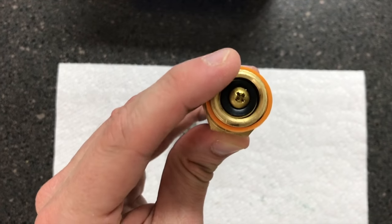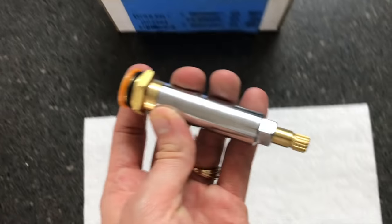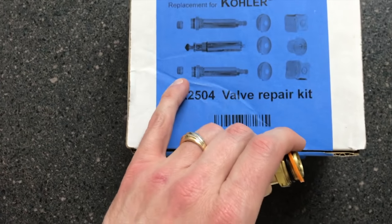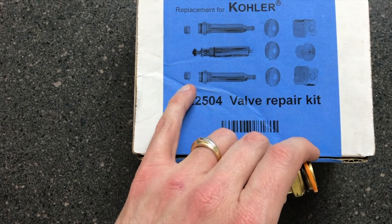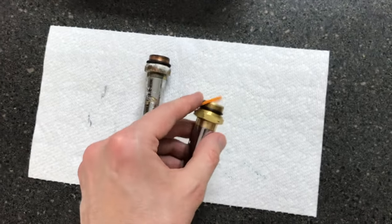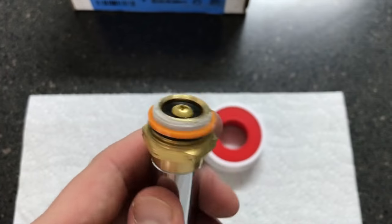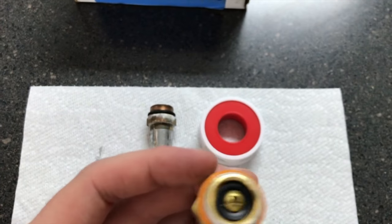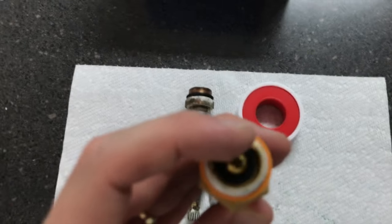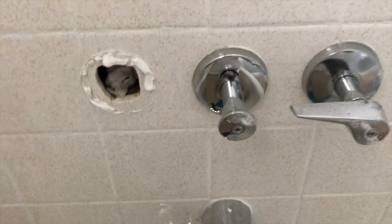On the actual inner portion is a rubber gasket held down by a Phillips screw — very important. As you turn the knob on and off, it moves that gasket. When you turn it on, the gasket releases from the internal seat and allows water to flow. When you close the knob, it pushes that rubber seal up against the internal seat, creating a watertight seal. Make sure all of that's there. From here, add a little Teflon tape — wrap it two to three turns and do not allow any tape to obstruct the hole.